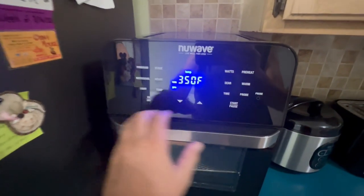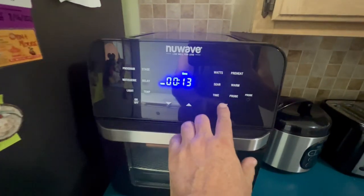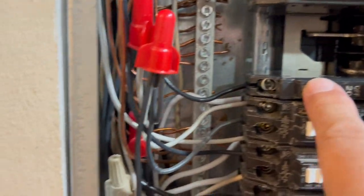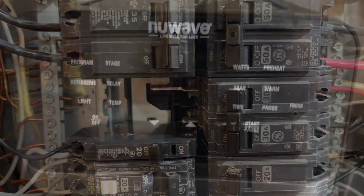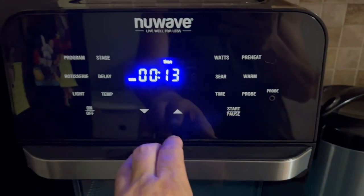Okay, here comes the test — let's get this thing going. We want a time of like 13 minutes — preheat. And it still tripped, because probably of the required arc fault breaker; this appliance doesn't want to get along with the arc fault breaker, even though it's connected correctly. So I'm changing it to a standard slim breaker — so I can get more in there — and getting away from that arc fault breaker, even though the arc fault breaker is required. If it's not going to work in the kitchen and keep tripping, we're not going to use it.